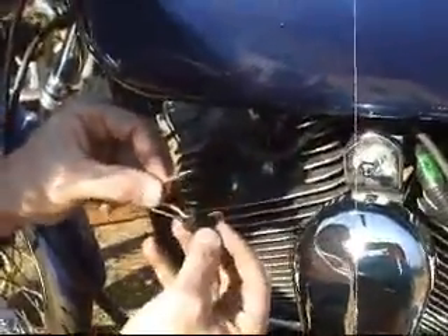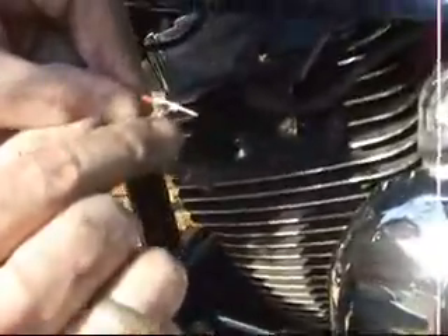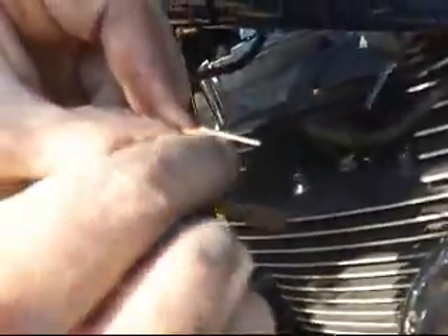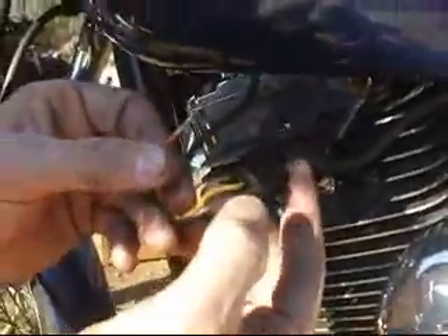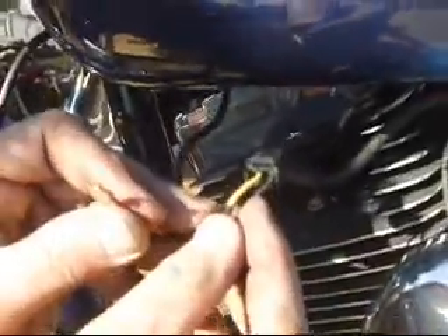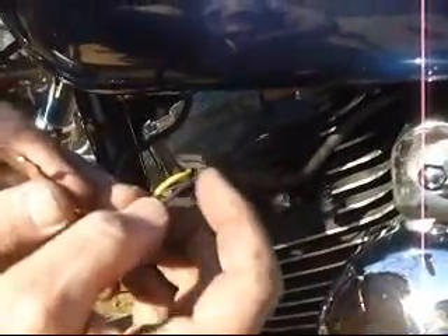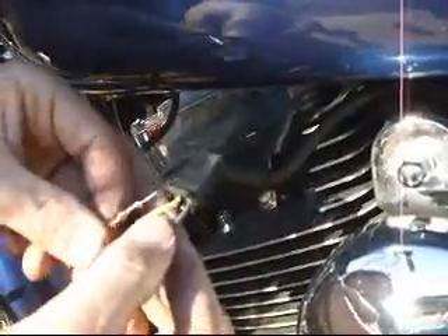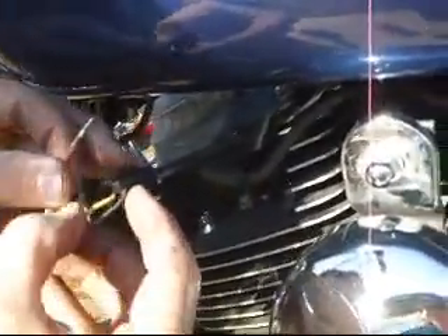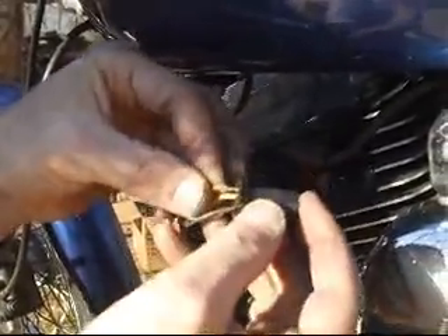These do have to go in a certain way. Notice the pin — here's the bottom of the pin, here's the pin itself. There's actually a little clip; if you run your finger you can feel this little slight rise in the pin itself. With the back open and facing you, it's black. We'll call, from it facing away from you with the back open, this first pin 1. You skip pin 2. Pin 3 is yellow and pin 4 is orange. This fits in like so — slide it in and it'll click into place.